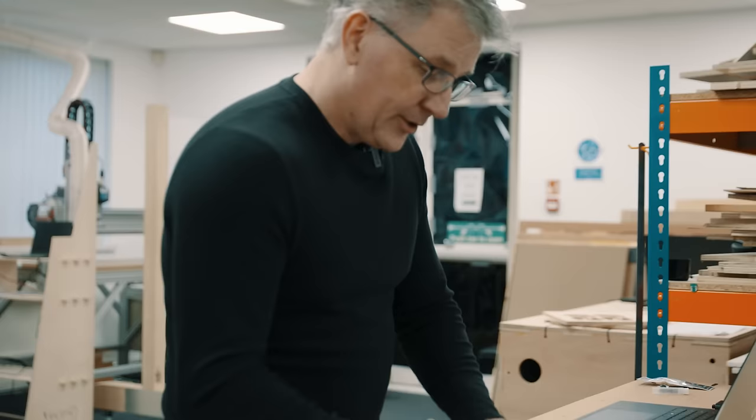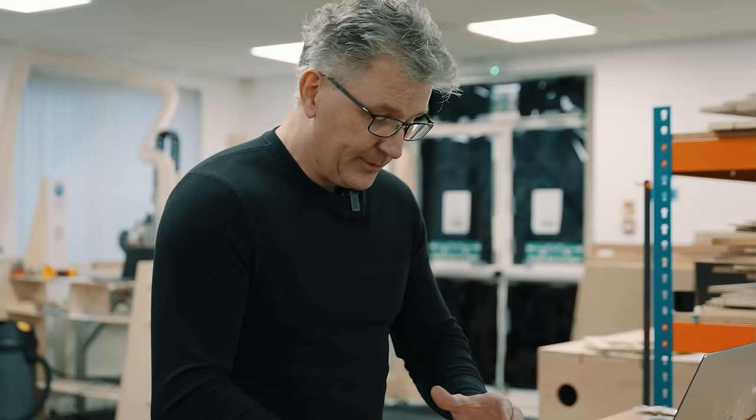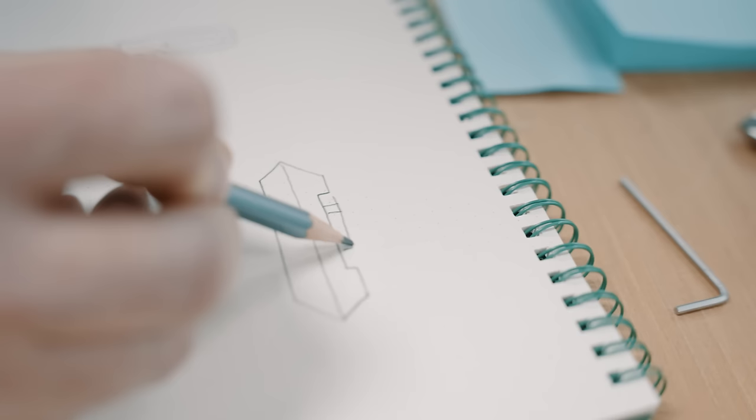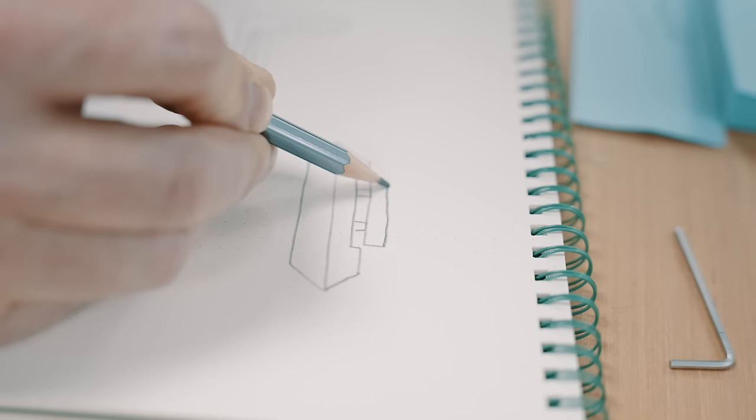So I think this is gonna be a two-part thing. We're gonna make a bottom that looks like a part of a boat, and a top, and we're gonna stick them together. And on the top, we're gonna add a block that we're gonna bolt into the base. And what that will do is it'll allow us to loosen up the top and put some sanding paper in between it and then clamp back down on the top.